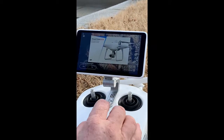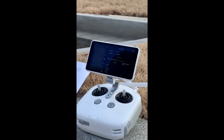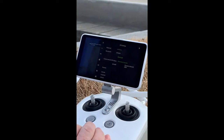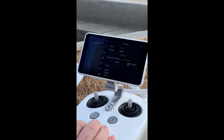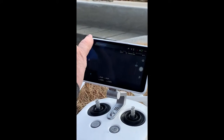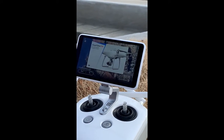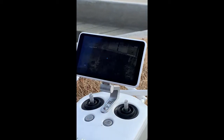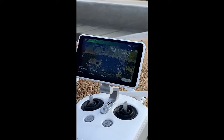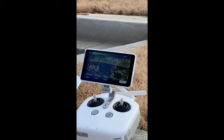Go back to the app and go to fly. We want to connect to the RTK network — I'm on the N-Trip network here. Once we have a good connection, go back, click on DJI, back on plan, and click walk with handheld RTK. You'll see measurements coming across: elevations, longitude, latitude. We're ready to set a point.